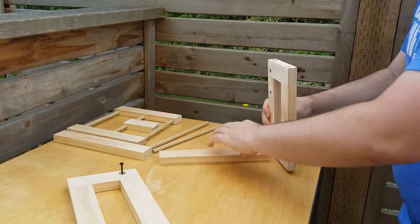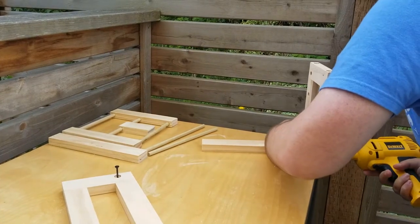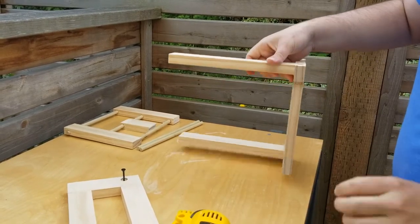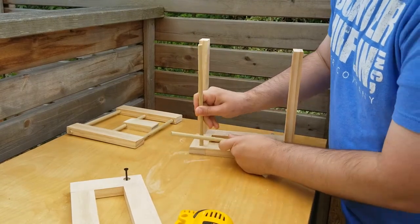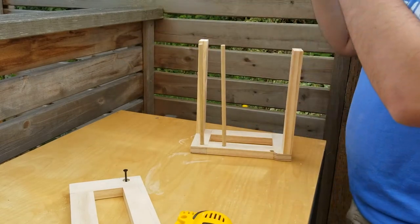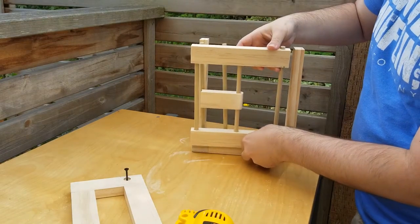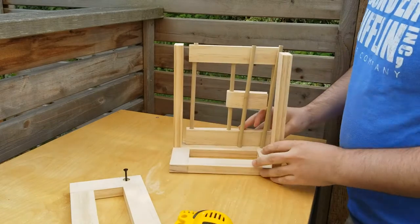To create the main base, I had already pre-marked and pre-drilled exactly which cross piece goes with which side, so I'm just realigning those to make sure the right pieces go together, and then I screwed in the top and bottom to this one side piece. On the inside there are three holes that we had drilled partially through — the two back ones will get full dowel rods, but the one up front is where that little dowel rod nub goes to act as the hinge.